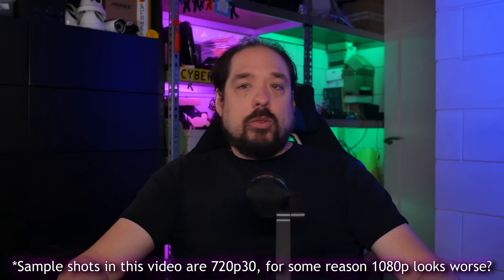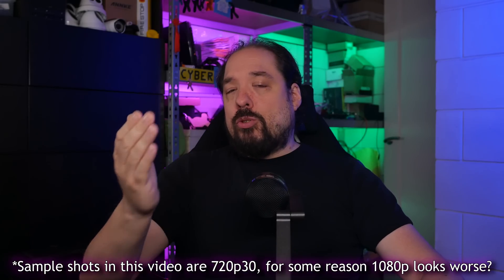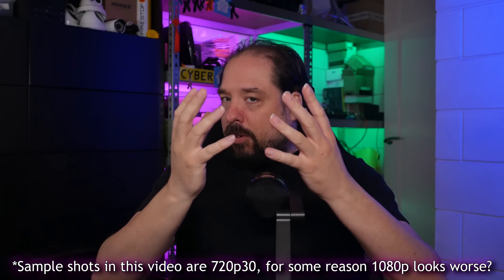Video quality is the best I've seen to date for any video doorbell. It's not the best camera out there, but it's quite okay. You can enable 1080p, 30 frames per second, with an 8 megabit stream in H.264, and that makes it pretty good quality. During night, it has night vision with IR, but IR is only turned on when someone presses the bell — so by default, for the rest of the time, it's off.